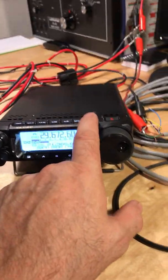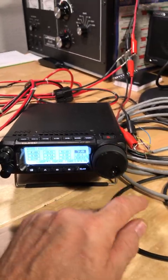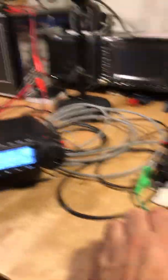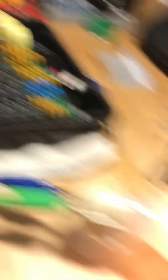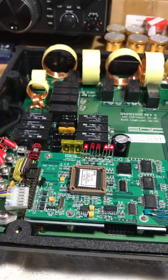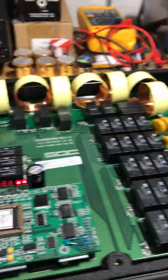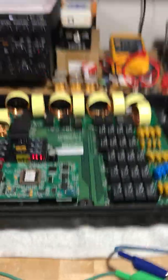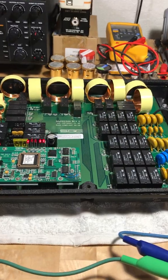There are some quirks — I don't know how to fix them or if they can be fixed. I'm at the point of thinking this is a firmware issue. The SG-237 100-watt version works so much better and faster. Switching to 40 meters — high SWR, but we do have a glow, so it's somewhat usable. It pulled something out of memory, heard it click, pulled a different combination — SWR is under 2, not ideal but the bulb is moderately bright. To reset this thing there's a blue wire — if you ground it, you'll hear the relays click; that initiates a reset.